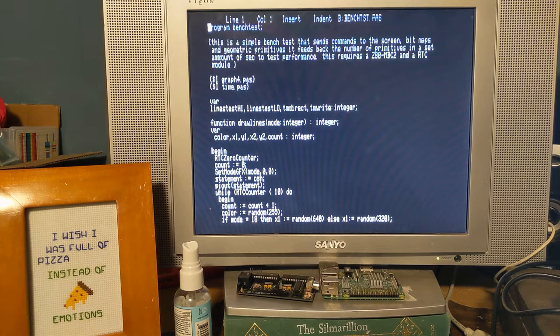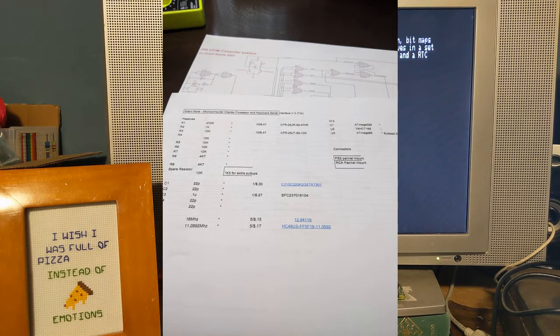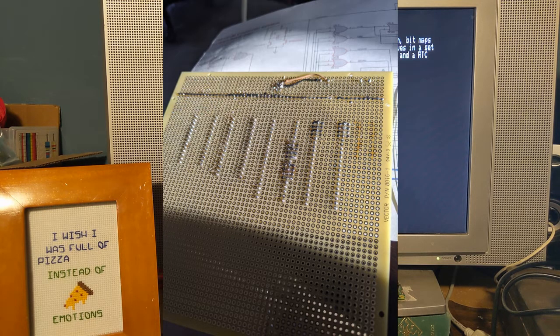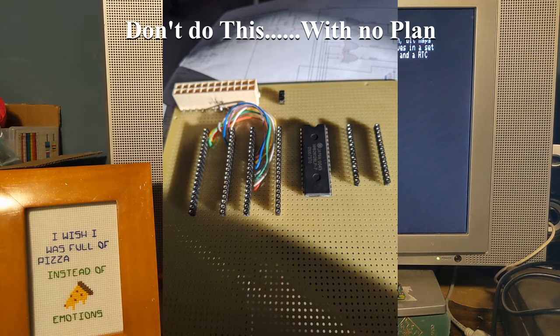Additionally, when I started out to build my own games console, I envisioned a completely different Z80 SBC at the heart of it. I had initially picked Grant Searle's breadboard Z80, and I even bought most of the parts and started hand wiring it from scratch. It was kind of a non-starter, but it led me to learn a lot of things about prototyping, mainly that you want to start a project like that on a breadboard and build up a PCB, socket it, and try not to hand wire it when you are a novice.